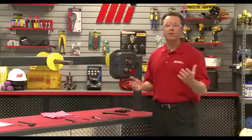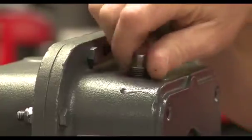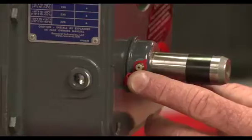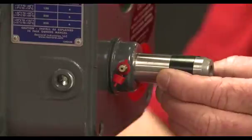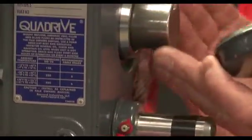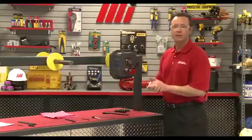Finally, fill the unit with the right amount of lubricant and reinstall the air plug. You should also re-grease the high speed seal until grease purges from the high speed seal cover. Wipe off any excess grease from the shaft, then reinstall the hollow shaft cover — for demonstration purposes you can see it here, but it will sit flush. Install the cover and you're ready for the final checklist.